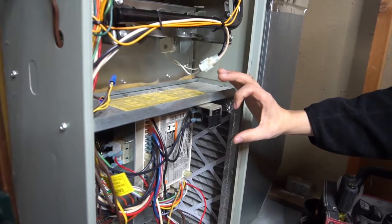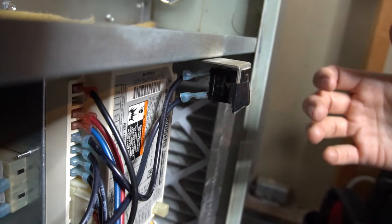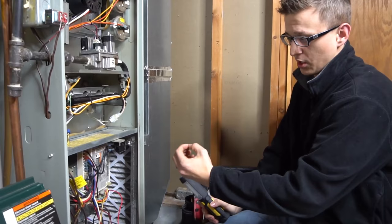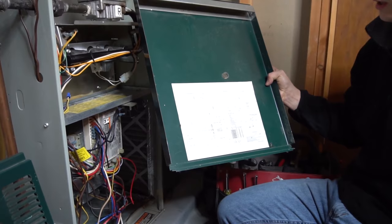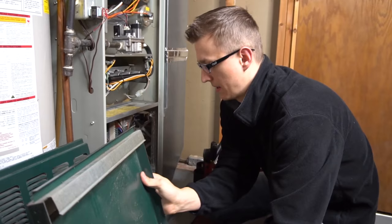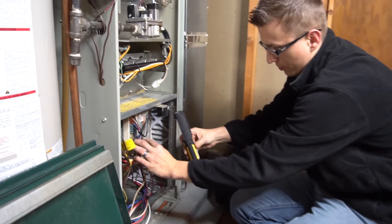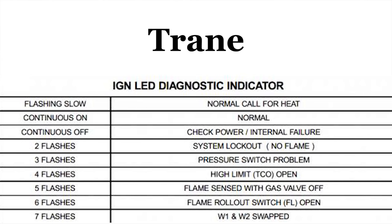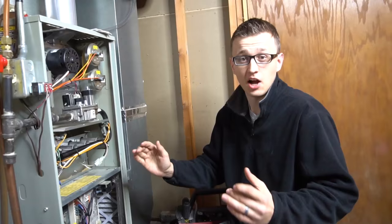As you can see, I just have mine taped up. Or if you have a strong magnet, you can just pop a magnet on top of it when you're troubleshooting or if you want the furnace to be running while you have the doors off. Otherwise, this switch when it's popped open will interrupt the power and everything will be blank. On most furnaces, the explanation of those error codes will be on the back of either the top furnace door or the bottom door. On mine, all I have is a schematic — there's no explanation of the error codes. On this particular furnace, the error codes are actually right on the control board itself. Different furnaces will have different error codes and diagnostic charts, but for the most part the error code names will be pretty similar from furnace to furnace.